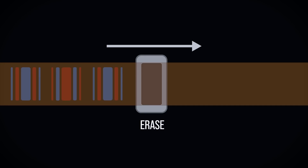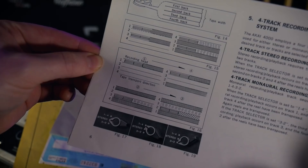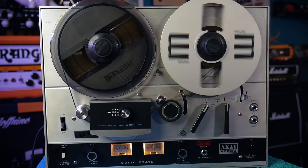The third head on this machine is an erase head, which obviously erases the tape by scrambling it back to a magnetically neutral position. The tape heads are split into two reading or writing elements and the tape divided into four tracks. This allows the audio to be recorded in stereo in both directions of the tape, or as four different mono recordings, two in each direction.